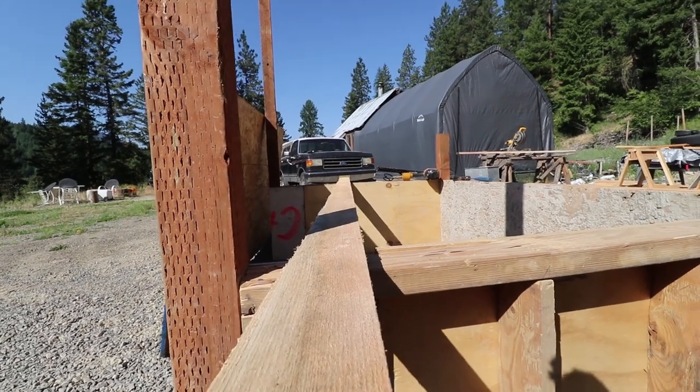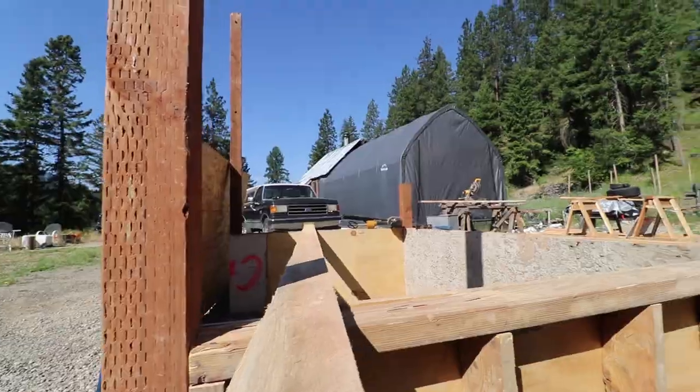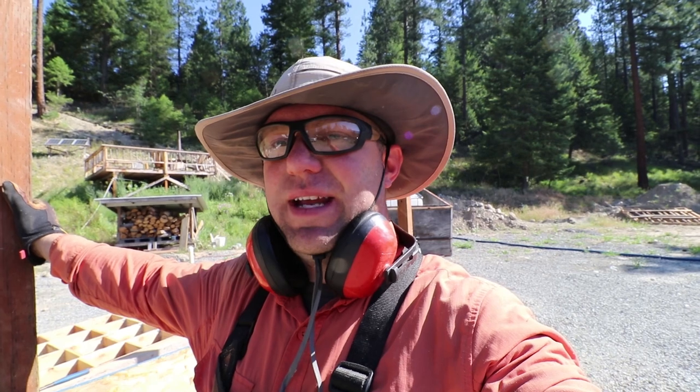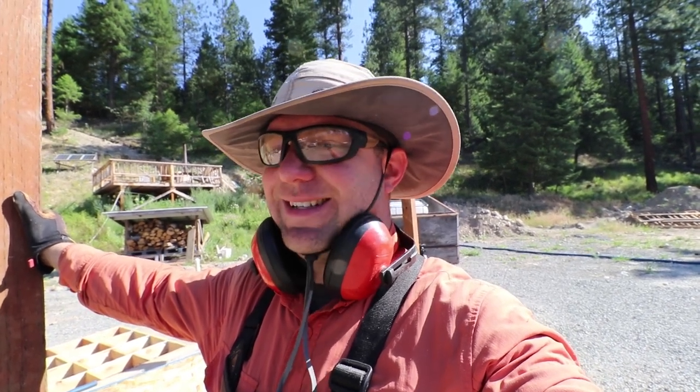Well, I have to tell on myself, there's a lot of dip and dive on the left side of this board. So yesterday evening, in trying to just get a million things done, I was in a hurry, and I left one of the side supports up after where my board ended, down toward the back end of the mill, which I thought, well, it doesn't matter really, I'm not milling down there. Well, I milled to the end of that board, and then to give myself just a little more room to work, I pushed the mill head forward. The blade was already turned off, but it hadn't stopped yet, and it bit into one of the side supports.